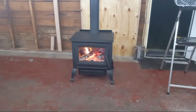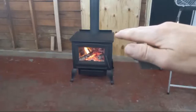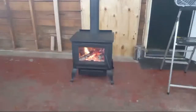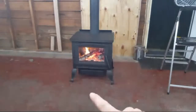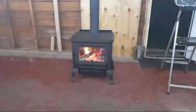I hope this helps anybody who had an issue like I did. Once again, there's a white baffle inside, above the door in the ceiling of the wood stove — it's supposed to be pushed to the back, not bumped up to the front. It can shift during shipping. And the knob: pull it all the way out for maximum venting, push it in for a slow burn. A little backwards from what I expected, but we've got it under control.